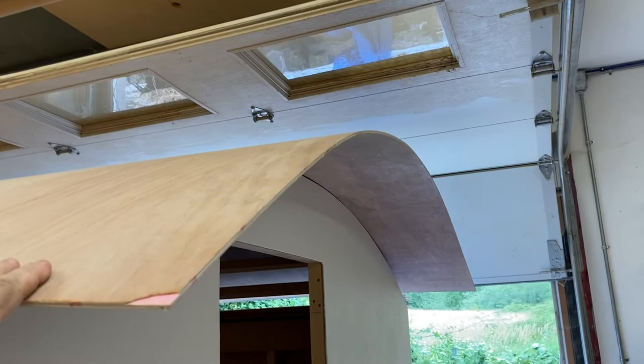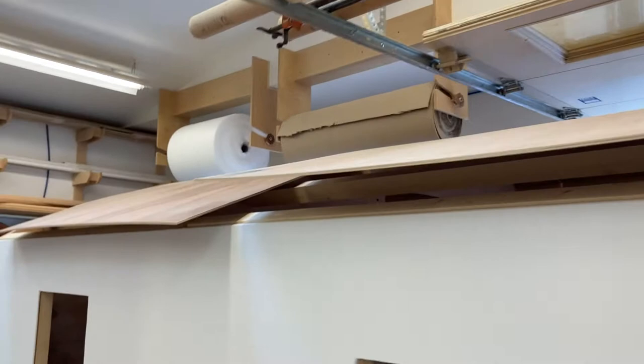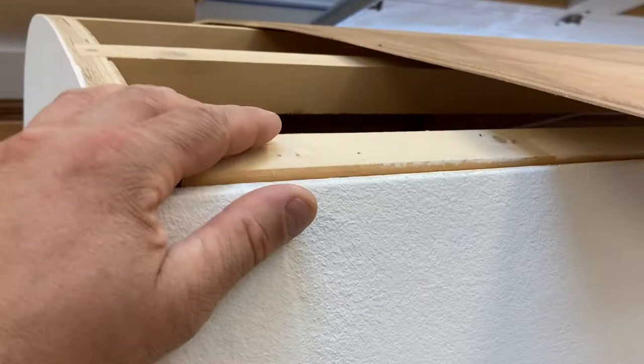These are actually my interior ceiling panels. Let's see how my roof is going to look — it's going to be built up thicker than this, probably half an inch plus some trim. I've got some nails here I've got to pound down or snip off. I've got to punch my nails down — it's a little bit proud. The piece was twisted, so it's a little bit fat here. I've got to hand plane that little chunk off.